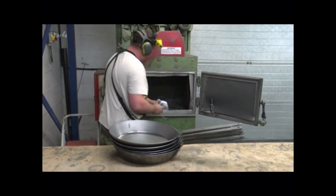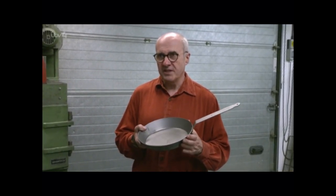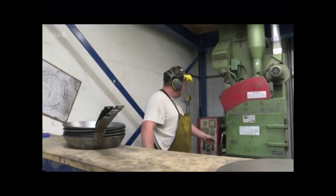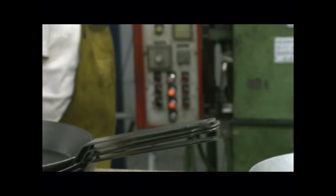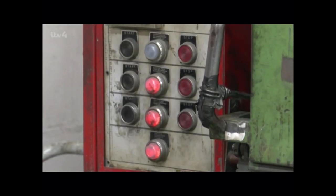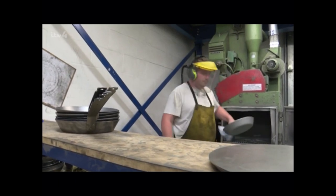There are no wrinkles on our pans — it's actually very, very smooth, and that's not very good for getting the seasoning oil to stick to it. So we're going to take this smooth pan and hand it to Carl to put inside this rotary shot blasting machine. Shot blasting is like sand blasting, only done with a fine metal powder, and that's going to put a very fine texture across the whole surface. We're very proud of this texture, because it ensures that once the oil's baked on, the oil doesn't flake off. There's a bit of a secret ingredient in here — we're not going to tell you that part.